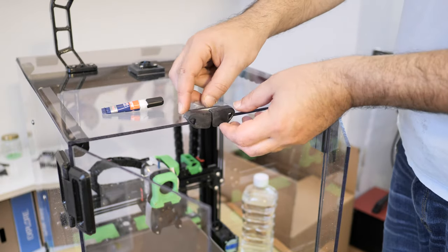Now let's see what temperature can be reached in the enclosure. I will measure it with the hotend thermistor while the bed is heated to 110 degrees Celsius, which is the ABS hotbed temperature when using a PEI sheet. In less than 10 minutes it stabilized to 60 degrees Celsius, which is great for ABS and possibly for small polycarbonate parts.